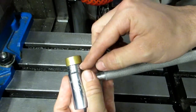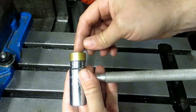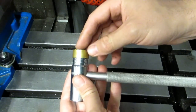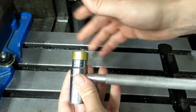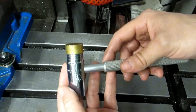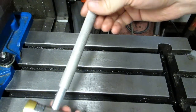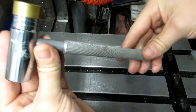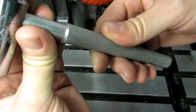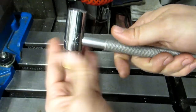I used some one-inch or 25.4mm stock. I milled a square on the end so I could press it into the half-inch drive of the socket, made it a little bit tight so I wouldn't have to pin it. The socket's pretty hard so it wasn't exactly fun drilling and tapping it. Then I made an aluminum handle with a fine knurl — not enough to rip up your hands but enough to get a good solid grip for when you need to smack the top of the drawbar.